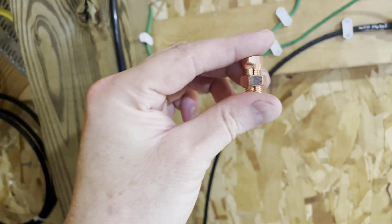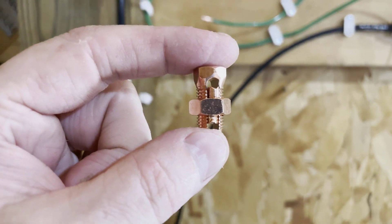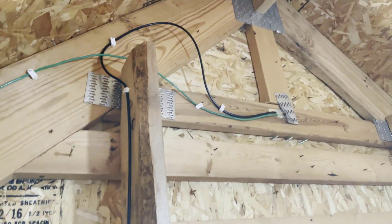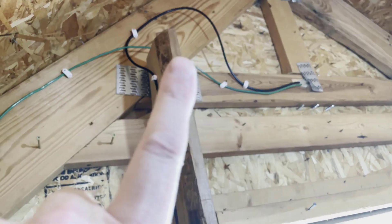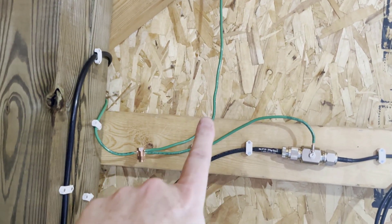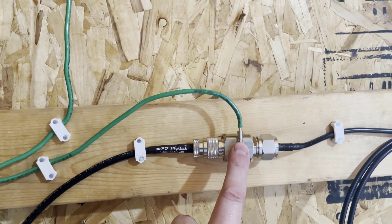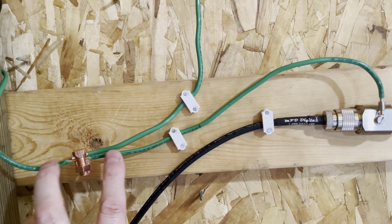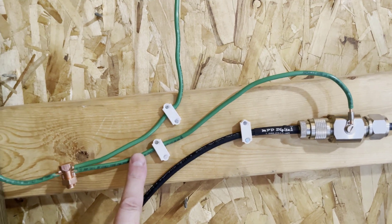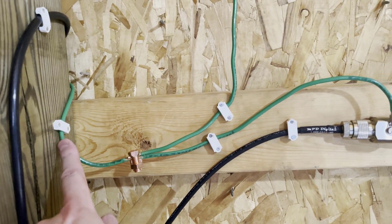This is not splicing. You're not allowed to splice per NEC guidelines — the electric code doesn't allow you to do a splice here. I've got a wire coming out of a device — a 10-gauge coming out of that lightning arrester going all the way down to the source. Coming down from the mast, I only need 17-gauge but I've got 10-gauge, and I'm doing it with this split bolt. I took about an inch of insulation off this wire so I could attach the bonding split bolt, and now this wire goes down to the electrical service. I'll show you where we join it down there.